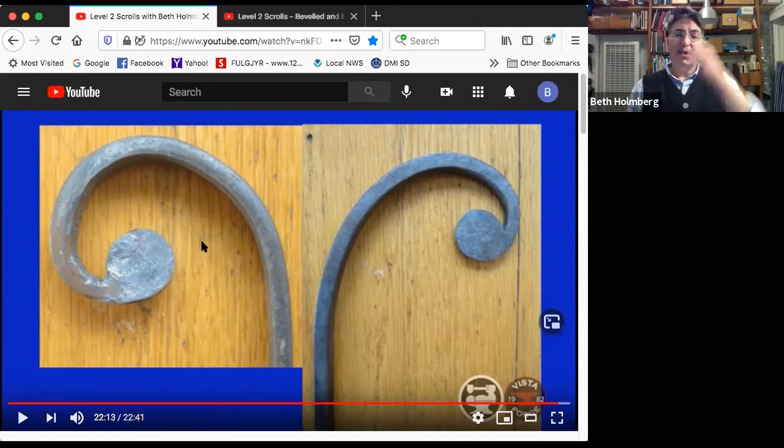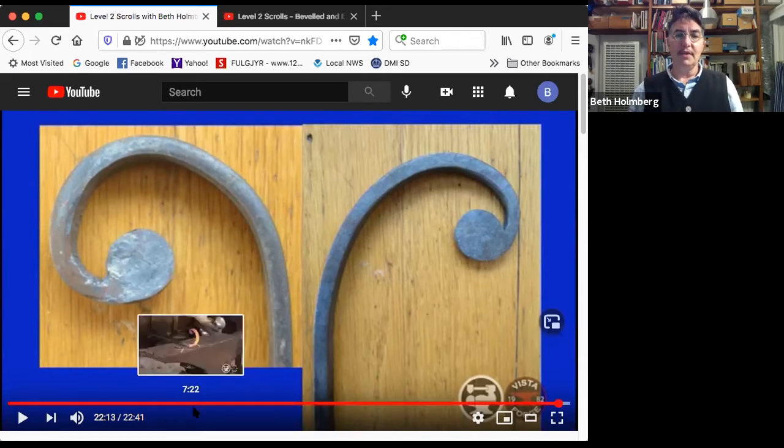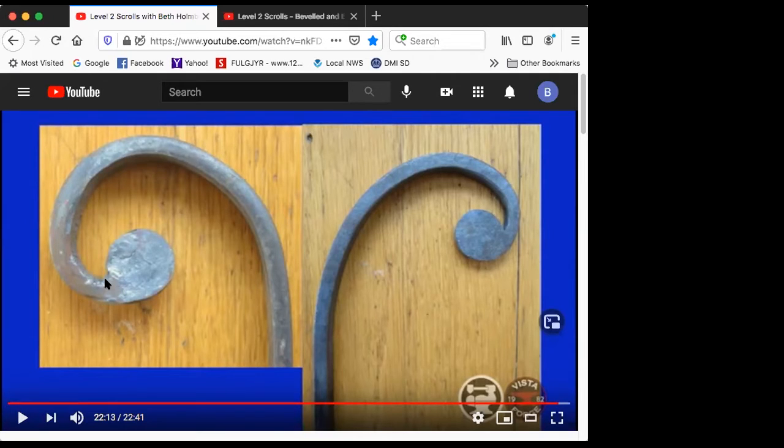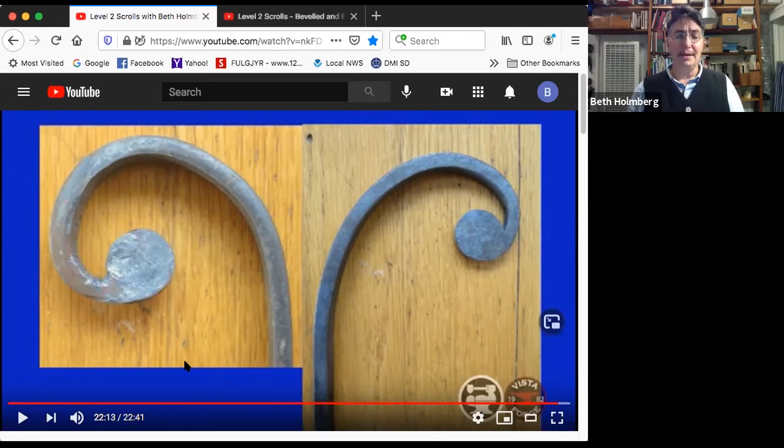That looks pretty nice. The one on the left, it's got a nice circular center. That's a nice penny, but the transition wasn't looked after. So what happens is I've got a round thing, and then I've got a stem sticking out of it. There's my cherry stem, almost straight, and then I get a bend. So it's almost straight, and then it bends a little tighter, and then it bends a little less tight, and then it bends a little tighter, and then a little less tight. So inherently, this is not attractive. That straight section here, and then I start the scroll, that is what makes it not look good. And frankly, what I've got here, I think I don't have an eagle's beak. I think with this weird thing, flat here, bigger here, I think I made a vulture. So that was not a success.